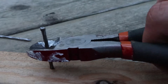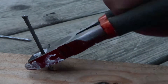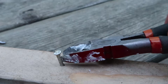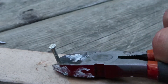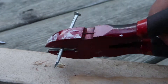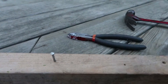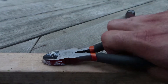Here's another demonstration. Using the same repeated pinch and lift motions, I quickly pull the nail out. Very easy. Here's another type of nail — again doing these repeated motions and I quickly pull the nail out. Sometimes the nose of the side cutter will damage the wood, so you just have to be aware of this, especially if you're working on furniture or something.